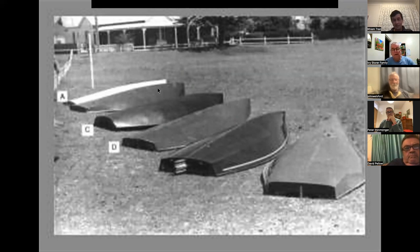Here are a bunch of NS14s from the 1970s. You can see that all of them are quite deep and V'd at the bow — there's a lot more rocker at the front and the boat flattens out at the back. That's what naturally happens. If the back is nice and flat, it forces the front of the boat deeper. This is the way we thought about dinghies because we wanted the long straight run aft that makes the boat fast. I agree — but in all things, moderation.